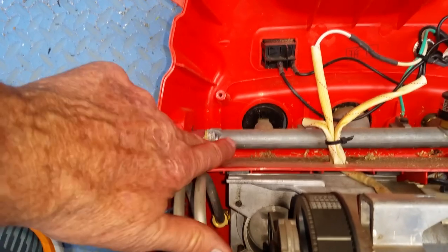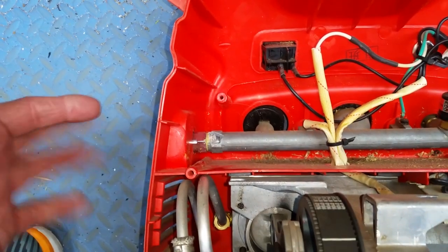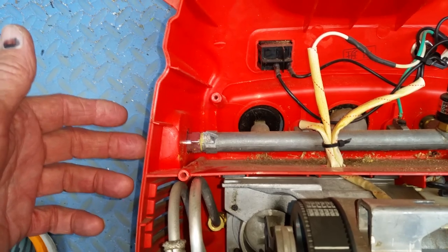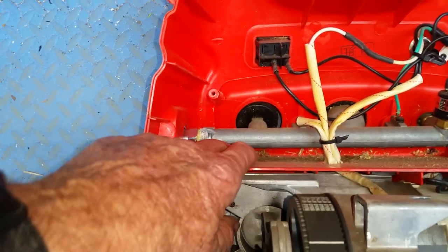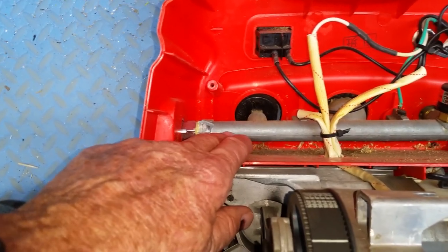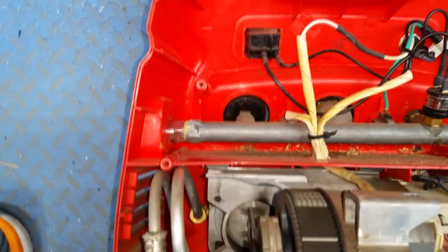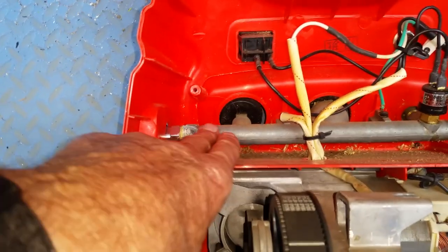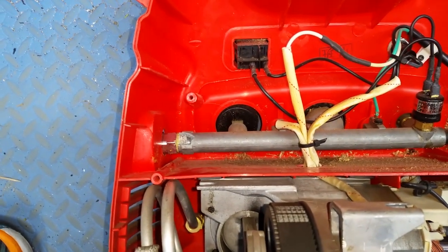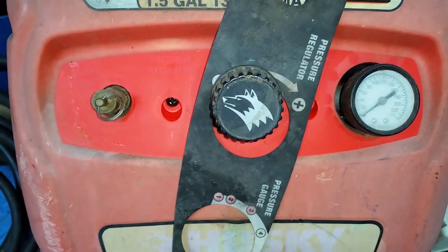What I'm going to try is take this thing out and get a quarter-inch NPT female coupling, drill it out, see if I can get it to slide on here. I'll have to get rid of that ridge and solder it, then I'll be able to thread it back in. The other option was to thread the outside and screw something on, but I like the first option better.